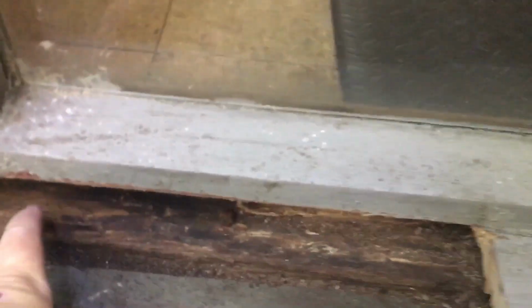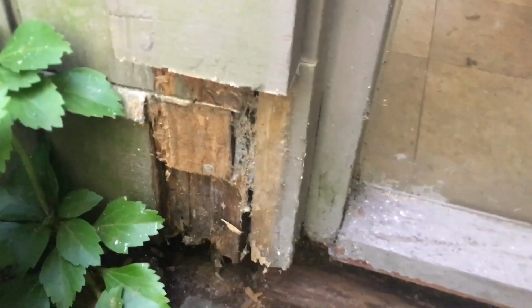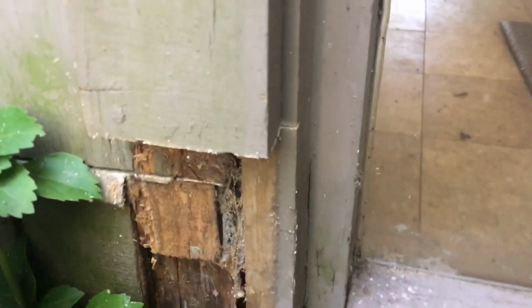All right, I'm in the process of cutting all the rot out. This is pretty solid down here, believe it or not. Okay, got a little bit more there. I'm going to remove. This is actually solid. I can get into that. Throw a few 15 gauge in there. I'll caulk the back. Try to keep the water out. But you know, when you're dealing with all this vegetation and you're in the shade, you don't get no sun. This is wet. This is damp feeling. It's been dry for a couple of days, so you can just imagine.